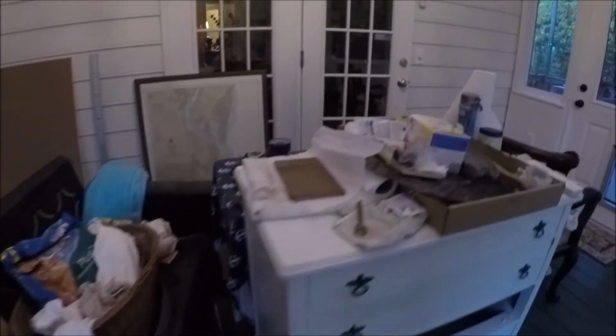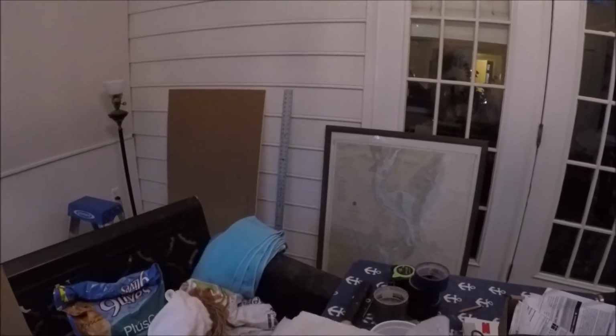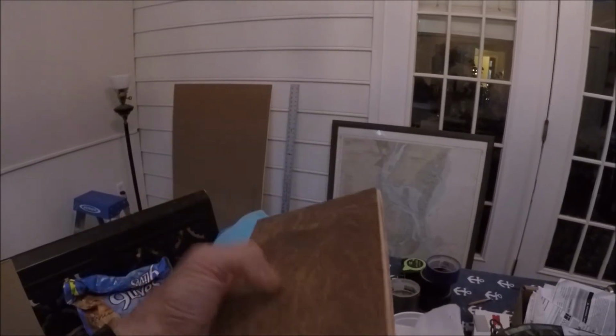Poly, but there's gaps in here, so I've got some steam coming up. So I'm waiting to finish up that little bit of sheetrock right there. A guy's going to help me. And then this is what's going down for the floor. I'm going to put a layer of felt, a layer of this foam, and then this engineered floor I've got left over.